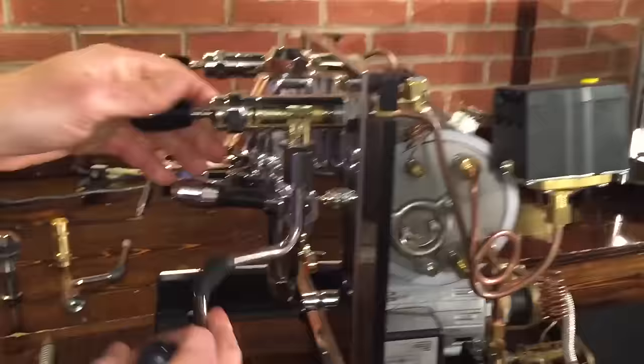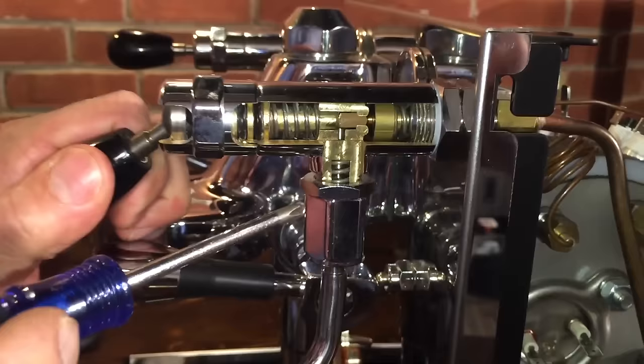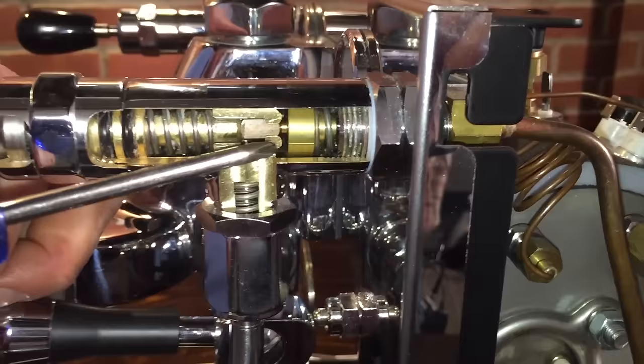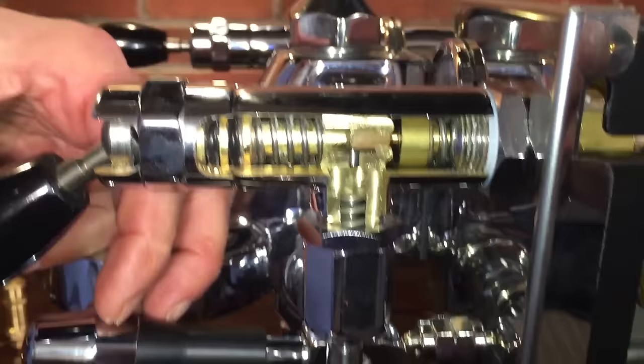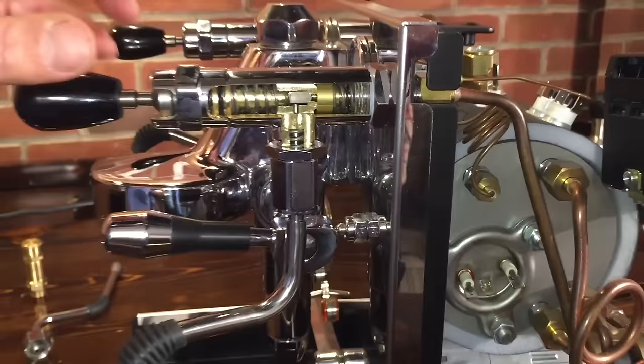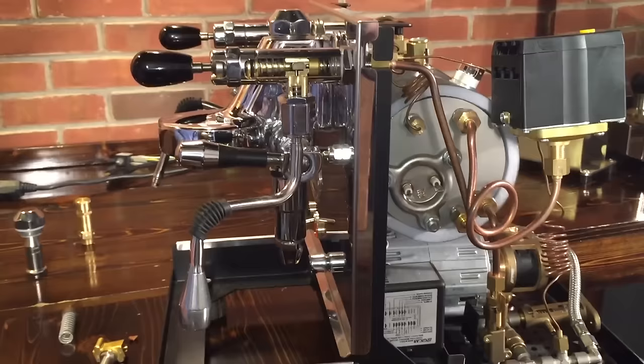Let's take a look at these valves. These are pretty cool lever-style valves. You'll notice when you push on it here, it opens up there. The hot water or steam comes through here but can't get anywhere because this valve seat is stuck up against the brass here. When you open this, it allows the pressure to come through and out and down, whether it's steam or hot water. The only pressure holding this on is just the spring, so it's not like screwing down a valve where you can overpressurize and damage it. With the spring, it's a more reliable, longer-lasting setup.